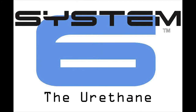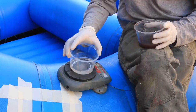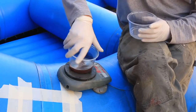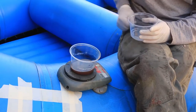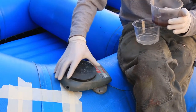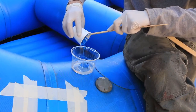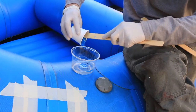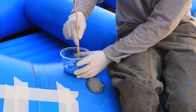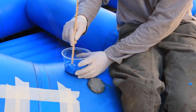The following 4 steps will take you through the urethane application process. If you are unsure about applying for the first time, then start with a small practice batch. Step 1: Rolling is easiest, so the following assumes the use of a roller. Use a short-napped 4-inch wide roller. Keep in mind that a roller will leave a semi-textured finish. Step 2: It is important that parts A and B be measured equally prior to pigment being added. If you are using pigment, add it to part A before mixing A and B together. Stir the pigment into part A thoroughly. It is important that the pigment is stirred well into part A, for it will not disperse properly when part B is added due to reduced frictional density.